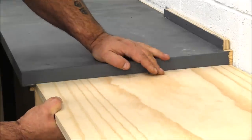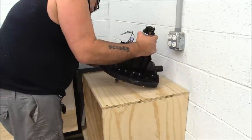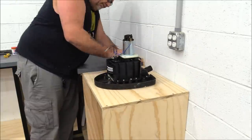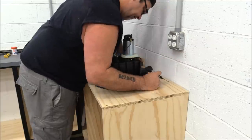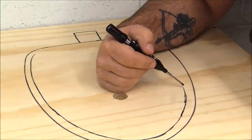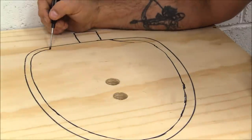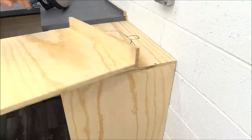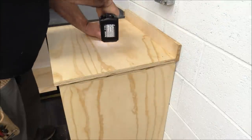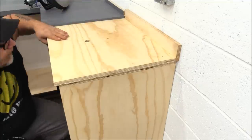To accomplish this I'm doing two layers on the top. The first layer I'll trace everything out and then move my line in a little bit and cut out a small lip. The spindle sander top will sit right on that lip. On the top layer I'll do a perfect trace of the top of the spindle sander so it sits recessed into the top part, and that should be plenty sturdy to hold it in place.